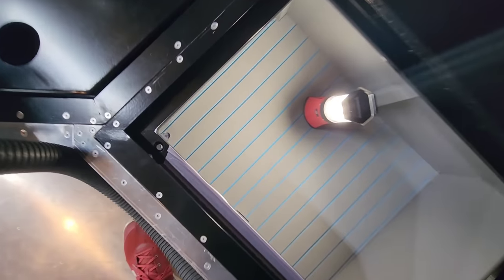I installed the drain tubes for all the front deck hatches. The anti-flood tracks direct water to these tubes, and the tubes direct water under the subfloor to the hull channels and to the back of the boat where the bilge pump is.